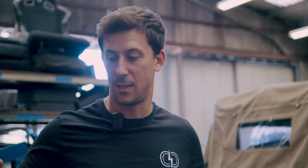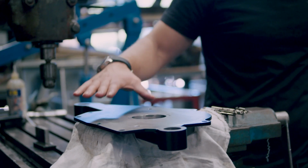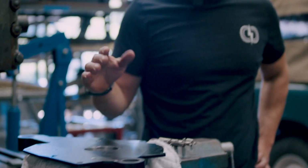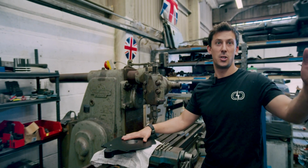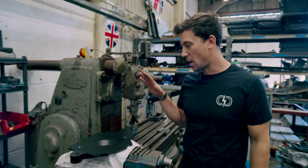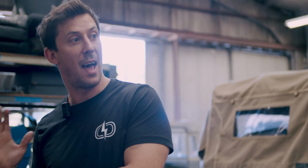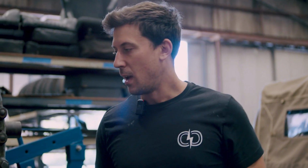We've just done is actually drill and ream the holes that are going to align our motor backplate and bearing housing to the motor, and it's a fairly simple process we got there. You saw Johnny with the jig positioning the holes with our tooling. So the next step is get it in the mill, which gives us a really nice, stable, strong and critically flat and perpendicular means of drilling a hole.